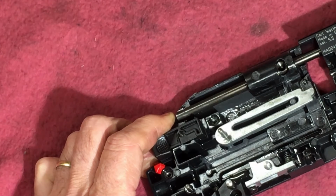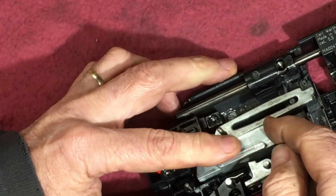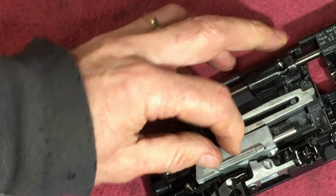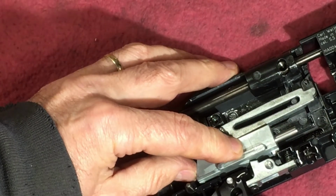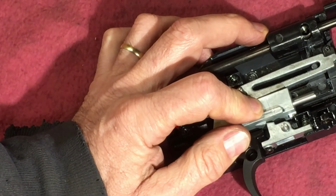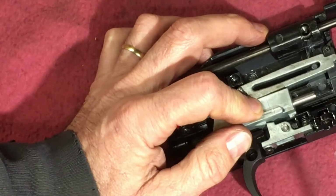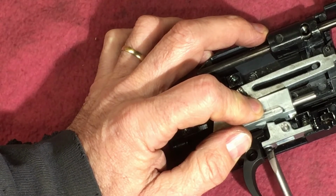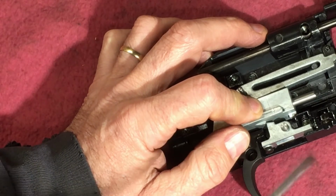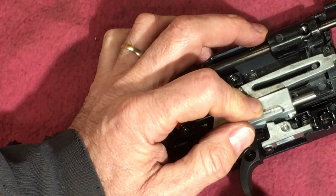This is the, well, let me drop that hammer back in without the spring, so you can see how it works. So when you cocked it, you're back here, the spring's pushing, so trigger. Adjusting the initial travel is this screwdriver, this screw here. That just changes when it screws up against here, removes that movement. I find it's actually just about right from the factory.